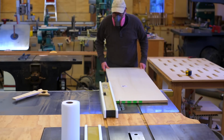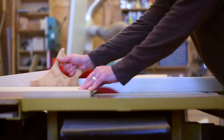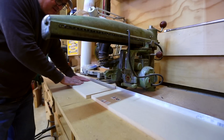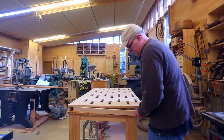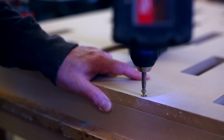And now to make a simple frame on the back side of that surface, just to keep that surface a little more rigid. So I can cut the sides and the bottom. And I'll put a piece along three sides, so two sides and then the bottom. And those are pretty easy. I can just put them in place and then attach them with screws.